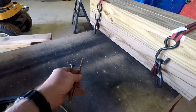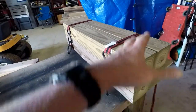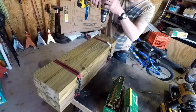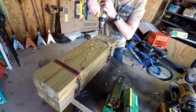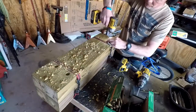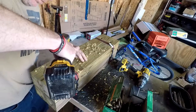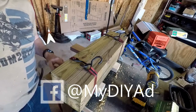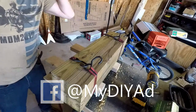I've got a bunch of these in 4-inch and 6-inch lengths, so I think with a little bit of countersinking I'm going to attach them all and kind of work my way out, attaching them all to these center four pieces. I'm going to offset these a little higher just so they don't crash into the legs I already put in.